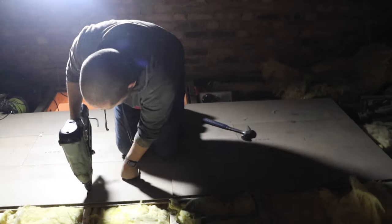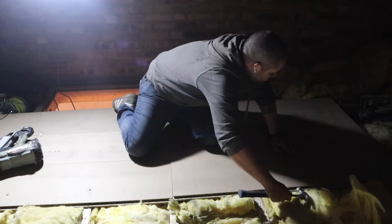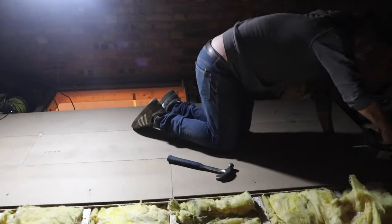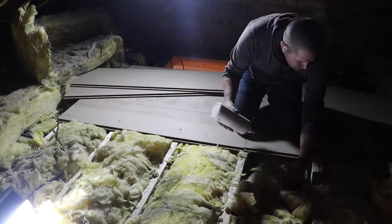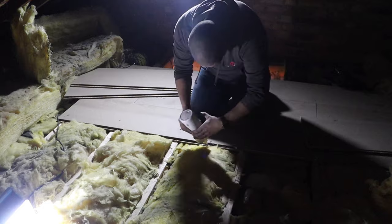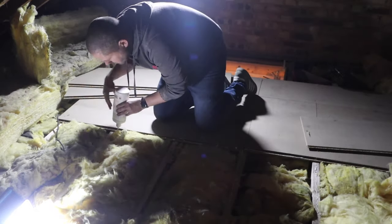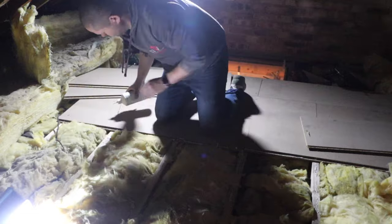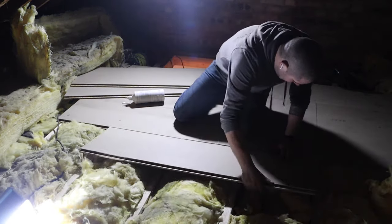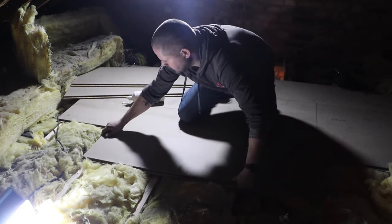So you'll see here that I don't nail it up completely at this stage. It just makes it easier to put a few nails here and there until you've got all your boards in, and then I go round at the end nailing the whole thing up. And equally here you'll see I'm not starting from the end every single time — it's because we want to stagger the joints. We don't want the joints all running together. So staggering them off so I can take a full board here, which gives me a 400mm overhang going on to the next one.